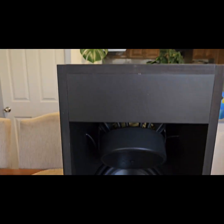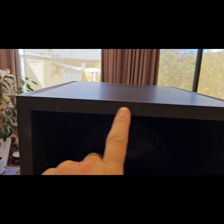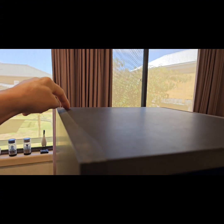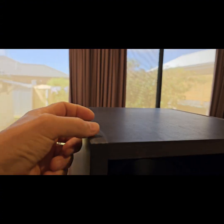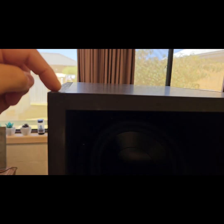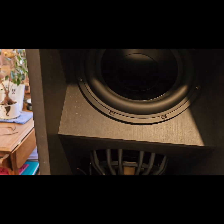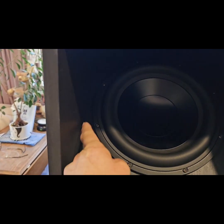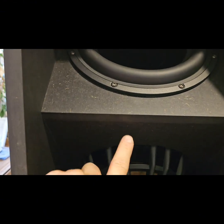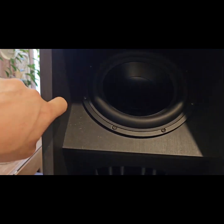Here is one of the base units that I built. The process for building these base units essentially is: this upper section had routed out sections in three spots, with biscuits that slotted in with some constructive adhesive in three positions. There were slots so that they literally all locked in together on both sides. The same arrangement of biscuits through these sections made a section that allowed us to slot that into the side walls.